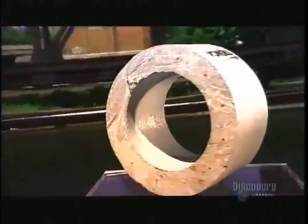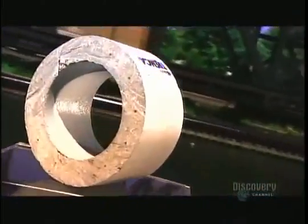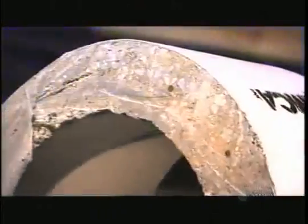Most underground sewer and drainage pipes are made of reinforced dry-mix concrete. Reinforced refers to the fact the concrete has steel bars inside it for added structural strength. Dry-mix refers to the type of concrete. You can mold it, then immediately extract it, and it holds its shape.